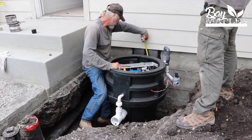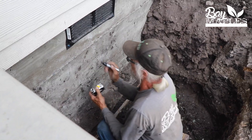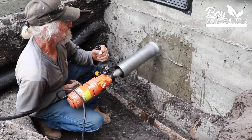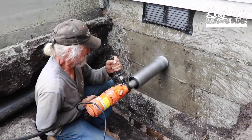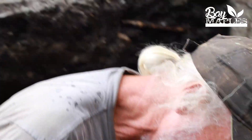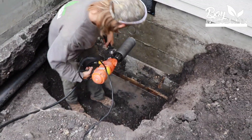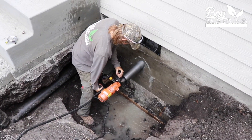One of the questions I often get is: are you able to store gray water? The answer is no, for a variety of reasons. One, that water gets quite disgusting very quickly if you're storing it. Secondly, the demand on your landscape is usually much higher than the supply side from your gray water, so it's really not offering any benefit to store the water. This system is designed to take the water as soon as it's being produced from a shower, sink, or laundry load, filter it, and more or less irrigate the landscape immediately.